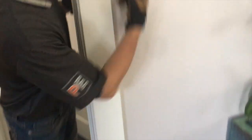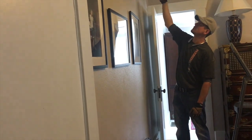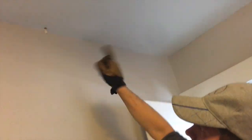In this situation we've tried fishing up this wall right here by removing this plug and drilling a hole. It's a metal box — you pop out the KO plug. We can't fish past this point. We're over here, and this area was remodeled years ago — the kitchen, probably in the last six or seven years. We're fishing up fine until we hit this spot. We did a tiny pilot hole up there so we can just mud it, and as you can see it's a small hole, though it did break apart the plaster a bit.